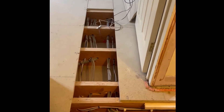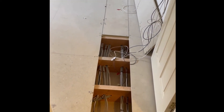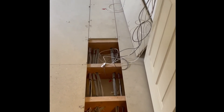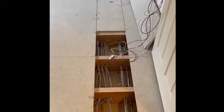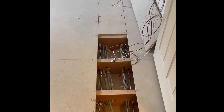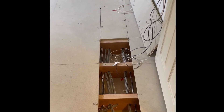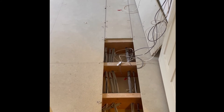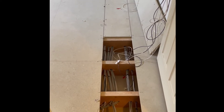This is the main trunk where we've brought the cabling, and every room has its own supply from the distribution board. We've got eight zones installed — it's not to every room, because in the bathroom, ensuite, and kitchen there's existing underfloor heating. We've tested it and it all works, so it's pointless causing additional cost when we've got sufficient heating in those rooms already.